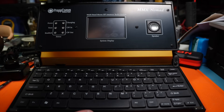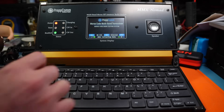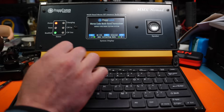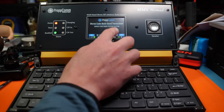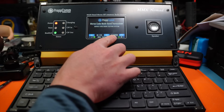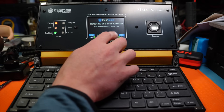I'm going to push the button on the back to start it up. It goes through a power cycle and gives you a little display. It starts up in external mode. External mode is like a pass-through — if you give it an audio signal from your radio, it will do the decoding for you and you can use it as a keyer. To get out of that, you click external and it goes through the bands: 80 meters, 40 meters, and 20 meters.